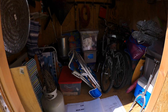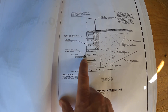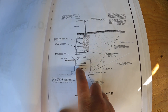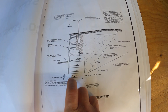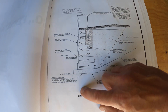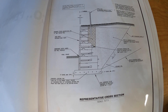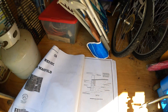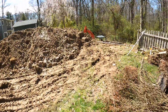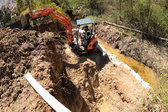I got the drawings set up here in the shed because it was raining this morning. Right here where it shows final grade, this is the bottom of the creek. We have a one-foot pad and then two rows of block that are buried under the bottom of the creek bed. This is a total of four feet. The whole wall altogether is 10 and a half feet, plus the 12-inch slab, giving us 11 and a half feet. He's digging about 12 feet from grade, so we might need some stone down there. At the current depth he's actually hitting a lot of small river rock and sand mixed in, so we may not have to add too much stone.